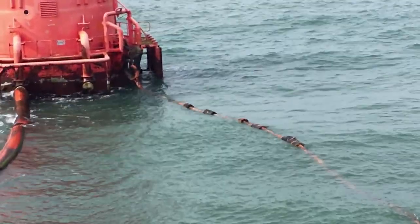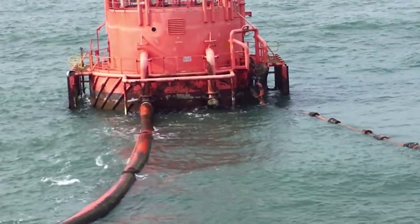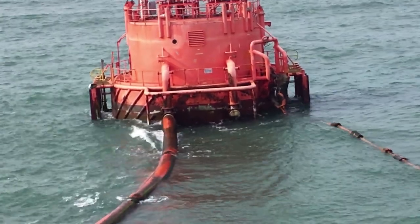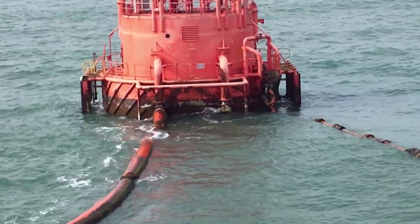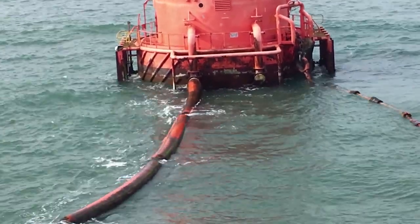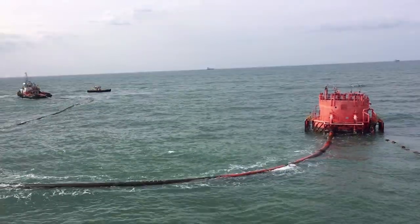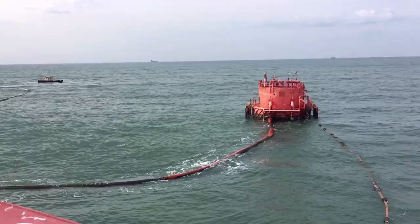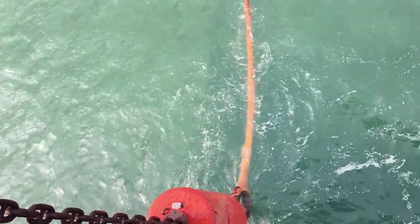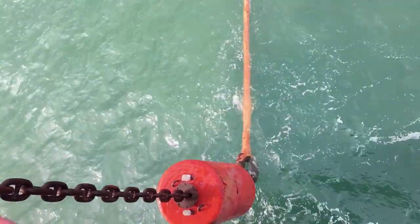Let's see what we have on the SBM. This is the chain from which the ship is anchored. Here we can see two manifolds — one has the hose which will be connected to the ship for cargo operations, and the other manifold is blanked. Apart from that, it has a ladder, a solar system for recharging its lights, and some ventilators. Currents and wind from the bow are pushing the vessel away from this buoy, which will result in some weight coming onto this chain slowly and gradually.